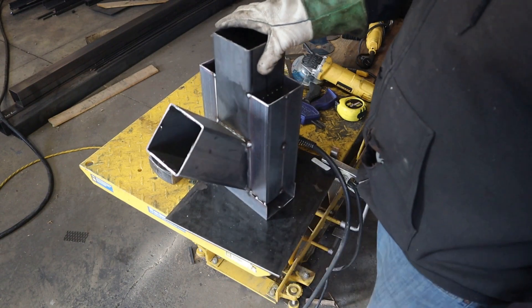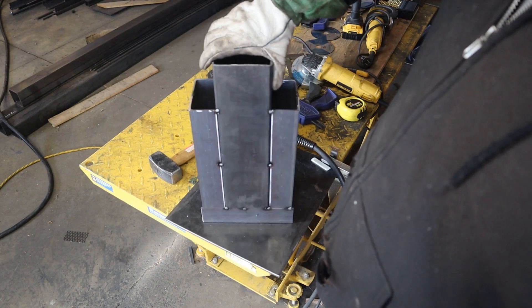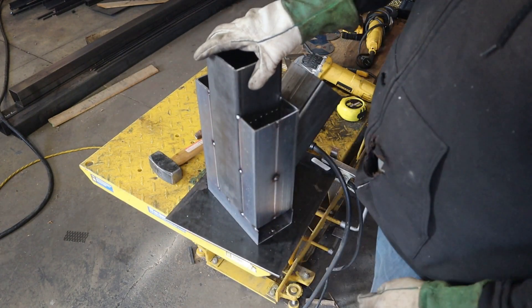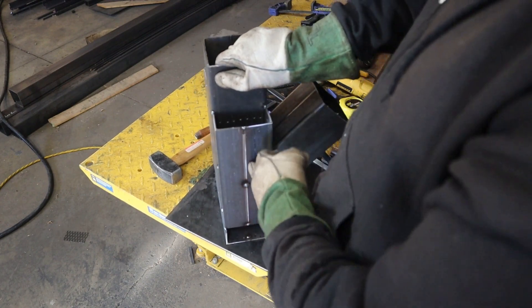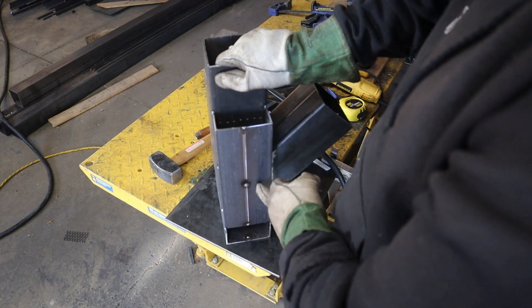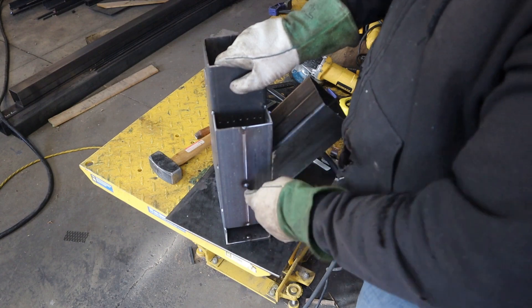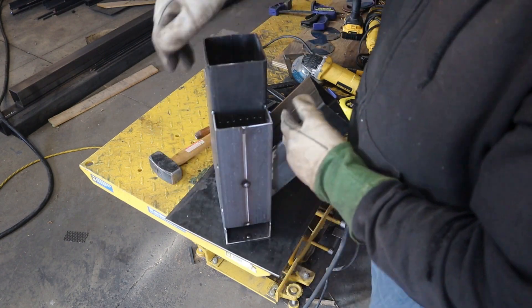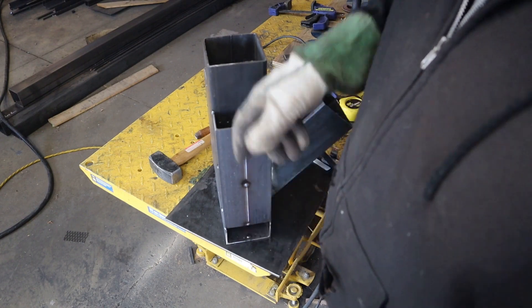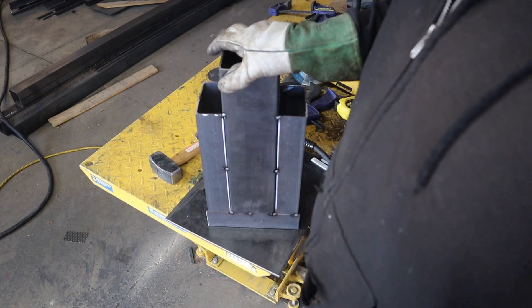Alright, we are ready to weld this up, but there are so many pieces it is going to want to twist and buckle all over the place. So I am going to be staggering welds all over the place as I go around. On these tight joints here, I am going to have to open them up with a grinder, because I really don't want any reinforcement on there with the weld afterwards. I am going to focus on these first, because when I weld the sides it is going to want to pull these out — there are only a couple of tacks — so we are going to put a couple of little beads on there, then weld the sides and move around on the bottom.